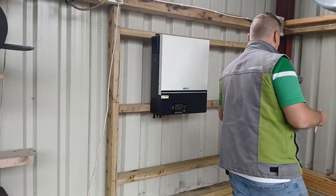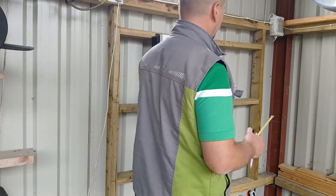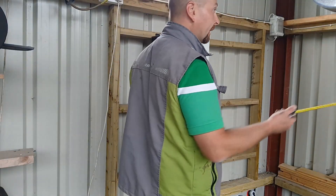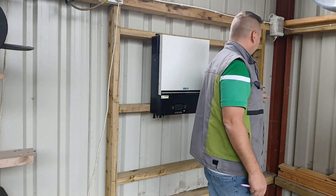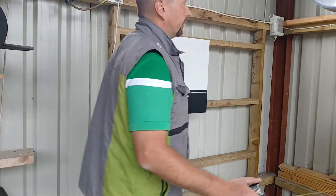What I was going to suggest is, before we go and start running the house off, leave it and fully charge the batteries — that's what I think, and that can be done. Your entire control of this flow to the house is at the 63 amp breaker. You switch that off, both buildings are shut down.